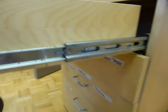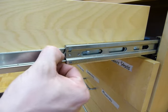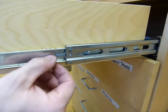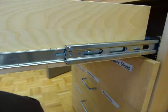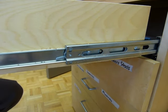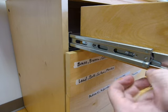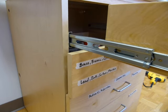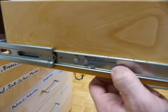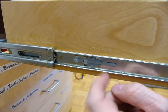Removal is fairly straightforward — much less problematic. You've got usually a lever on the side of the rail that's mounted on the drawer. Depending on which side of the drawer you're on, you may want to push this one down or pull it up, depending on how it actually works. On this model it doesn't matter — you can push it down or pull it up. Just ease it out. This particular detail varies from drawer slide to drawer slide, so it may not be the case with yours.